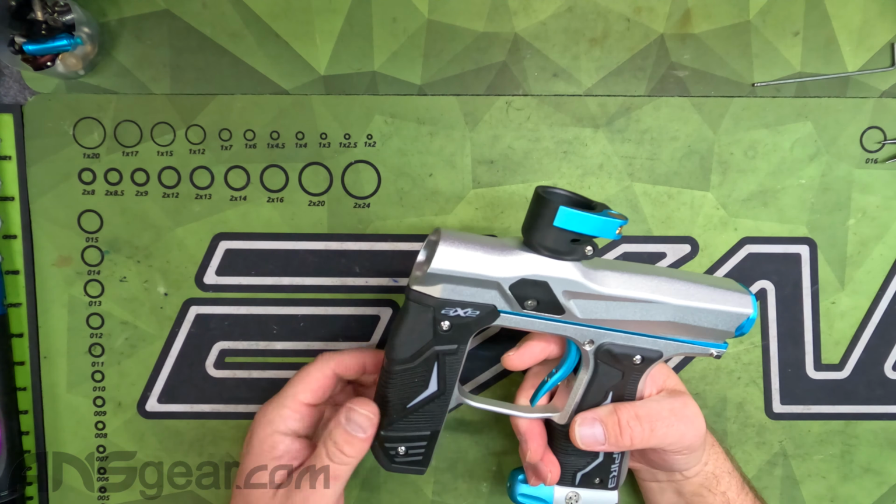So what we want to have happen, in the way that I do this, I take an Allen key and I put it in there. I'm basically indexing that core that I put in there so that the core can't rotate as I try to put the cap on it. Because if I put this in and start to turn this, the core is going to rotate also inside there at some point. I don't want that to happen. I need to keep that perfectly up and down right there. So I'm going to put this Allen key in there, which is roughly the same size as the slot right here. There we go. And then I can turn this